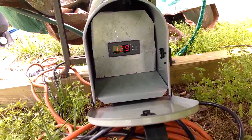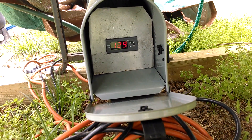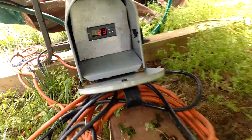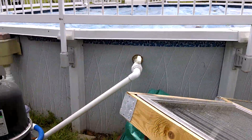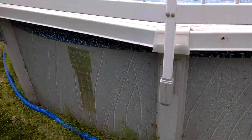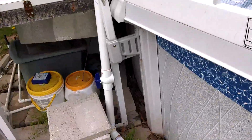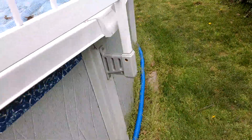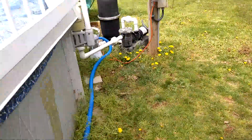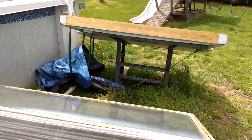This is set to go off at 130 and then cut out at 110. There's a sensing element inside the panel to read the temperature. I've got a feed coming in with a cutoff valve on one side of the pool going down into the pool. Put a cutoff valve on it for maintenance, so you can maintain your suction and see what happens when this water starts coming out.